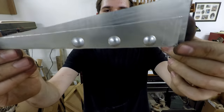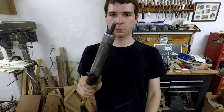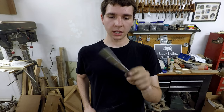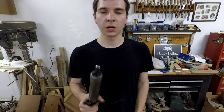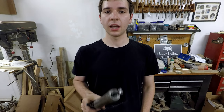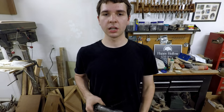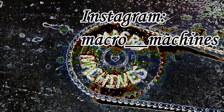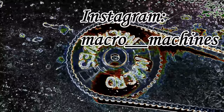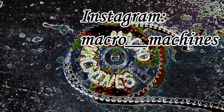So I put these last two rivets in there. As you can see, I went a little harder on them than I probably should have — I have the air set at about 80 psi right now, which is probably too much — but just as a proof of concept, it works fantastic. I literally threw this together in just a few hours one evening, so this is just a quick little video of something I thought would be a cool little project. You'll definitely see this in future videos of actually riveting things on the speedster I'm building — I'm planning to have rivet lines like this running all along the bottom edge of the body right above the frame, and I think that'll be pretty cool. So thanks for watching, and I'll see you next time.